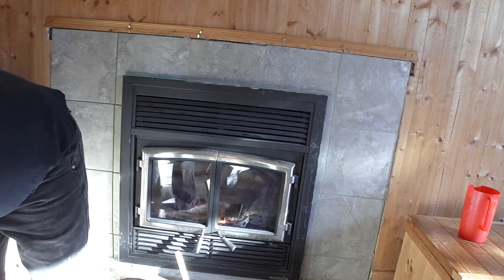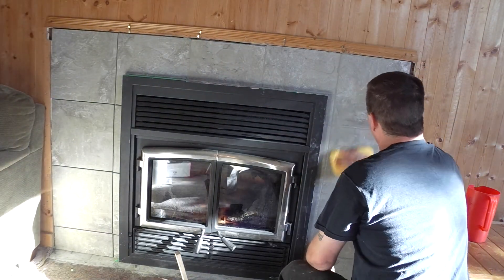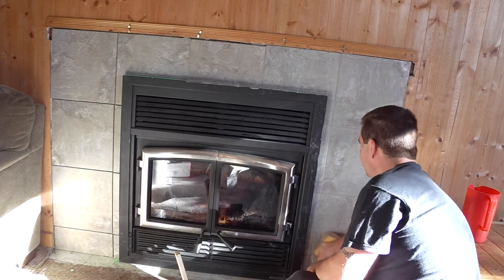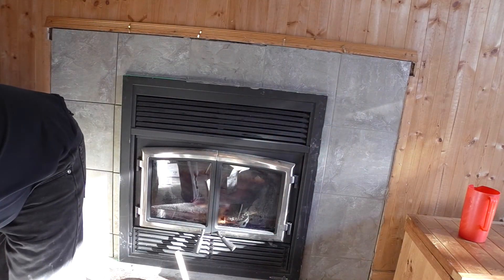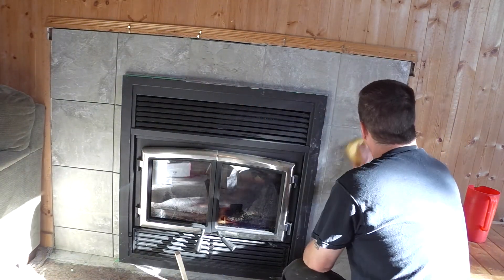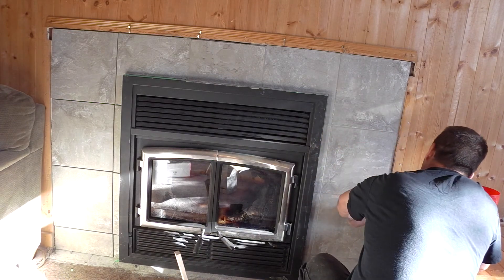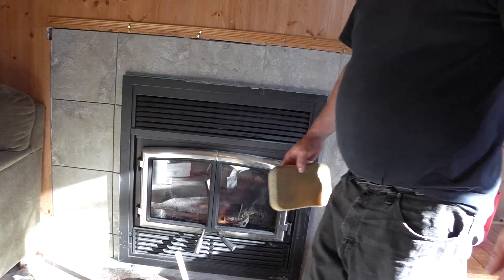So I'm going to show you how to clean it off. Get yourself a nice big sponge and a big bowl of clean water. Same idea — go on an angle. What's going to happen is you'll do this and it will look perfect, but you'll come back in a couple hours and everything will have a big haze on it. That's normal — just do it again. You may have to go a third time, but that's not a big deal. You're trying to smooth out everything, and the grout should be just a little bit below the line of your tile. That's it for this one — if you have any questions or comments, leave them below. I'll see you next time. Thanks for watching.